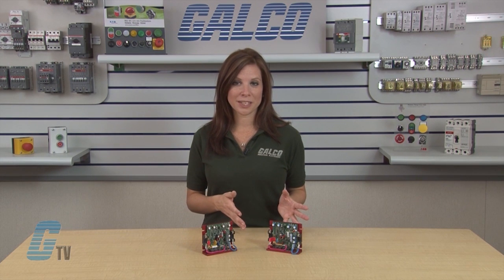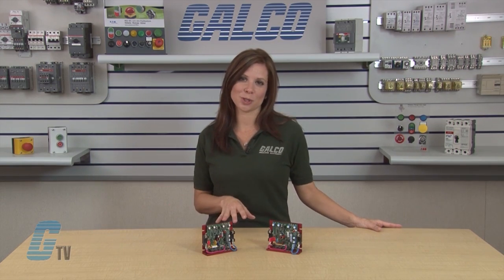In addition, the control can be used in a voltage following mode by supplying an isolated analog input signal to terminal P2 positive and F negative. The control is supplied with a 5K OHM remote potentiometer and QD terminals.